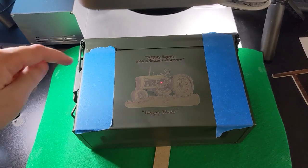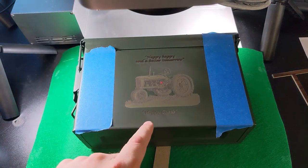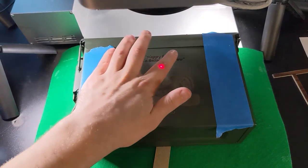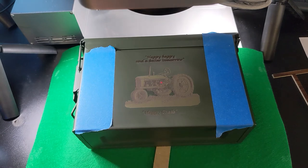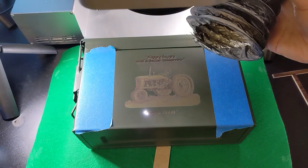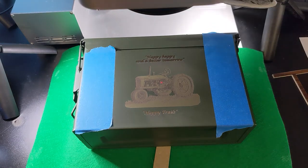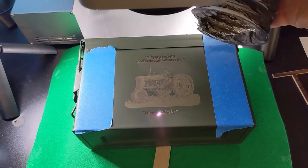Classic problem here — we got through the top way faster than the bottom. It's probably tilted back slightly, off on leveling just a little bit. I'm going to remove the top text layer and just keep going on the bottom until we match that tone. Still not doing it — we need more power or slower speed. We're at 90 power so we can't go higher, but we can go slower. Taking it from 500 speed down to 200. Let's try it again. There it is!